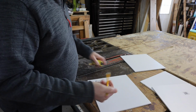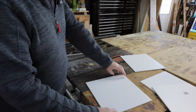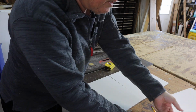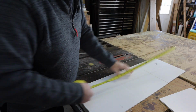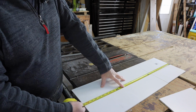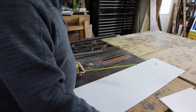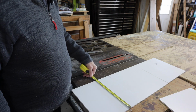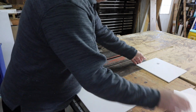All right, which means that this dimension is important because it is the dimension that I'm going to put, you know, right? So if I put 3 of them, they're going to measure 33, which is going to be the inside length of my bed. And same when I put 6 in this direction, going this way, I'm going to have 11 and a half times 6, and it's going to be my 69 inch, right? So what I'm going to do now is show you a little bit.